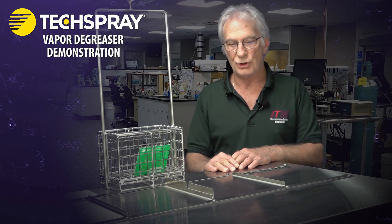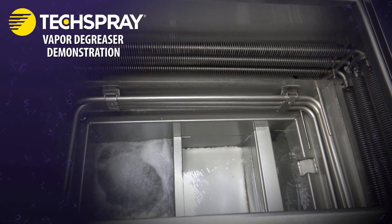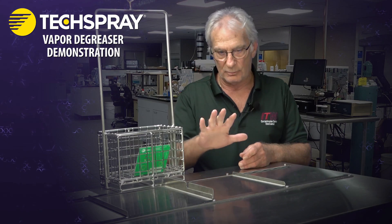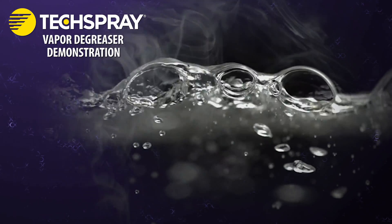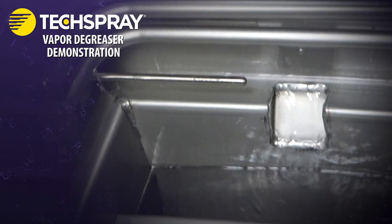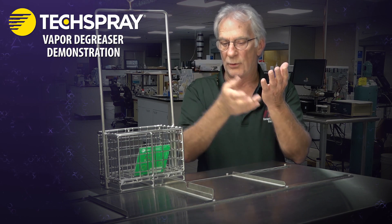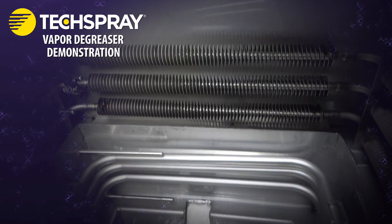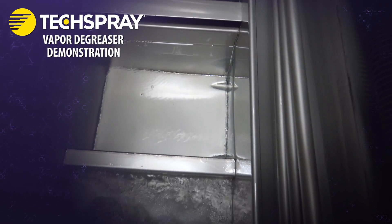A little bit about the actual operation — the functional zones and the work areas. The cleaning fluid is loaded in here and running. The liquid boils in one of the sumps or bins, creates vapors, and that goes up into your working zone or vapor zone — that's where the cleaning takes place. As those vapors continue to rise, they hit that cold zone where the condensers are, the refrigeration area, and they condense back to liquid, go into a trough, feed back into the distillate receiver, which feeds into the clean sump, which replenishes the boil sump.